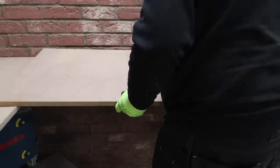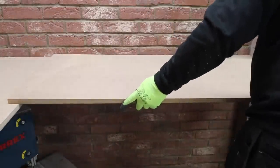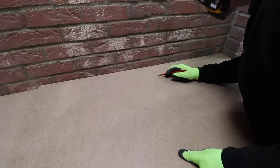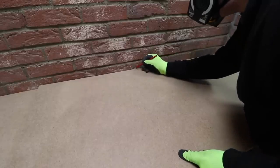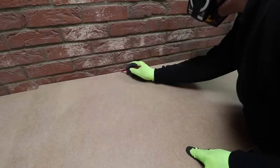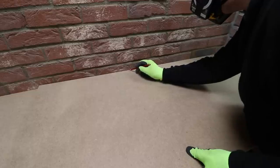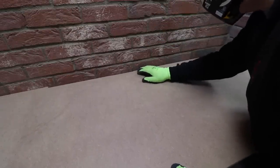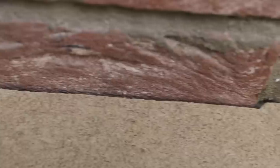When I offer up the piece it's rocking side to side because one of my bricks in this particular wall is sticking out by a few millimetres, so I decided to very roughly scribe around it and with a jigsaw just adjust the back so it fits properly. With a few millimetres taken away with the jigsaw it now just fits nicely.